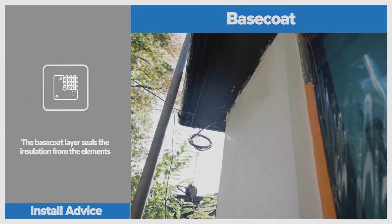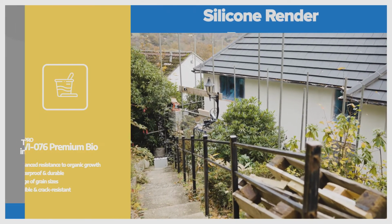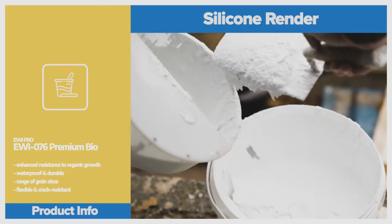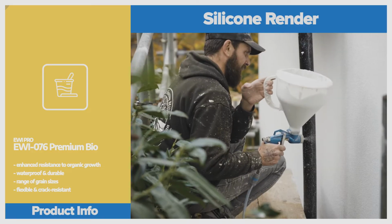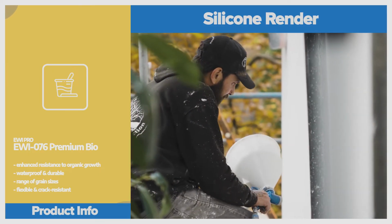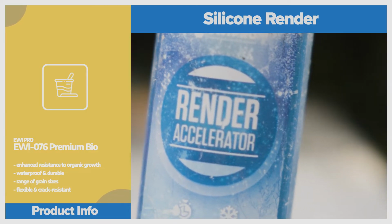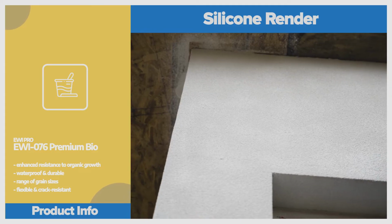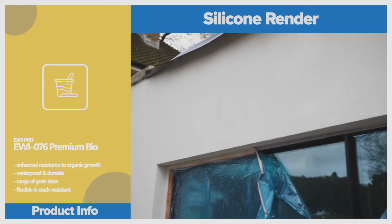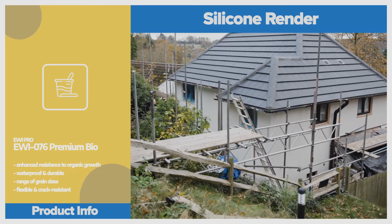With the base coat layer dry and primed, Tom was able to begin the final decorative layer of the system, which in this case was EWI Pro's 076 Premium Biosilicone Render, with enhanced self-cleaning and resistance to organic growth. During the application, Tom used a hopper gun to distribute the render evenly across the facade and achieve an attractive finish to the property. The homeowner chose to have his silicone tinted in platinum, which looks excellent.